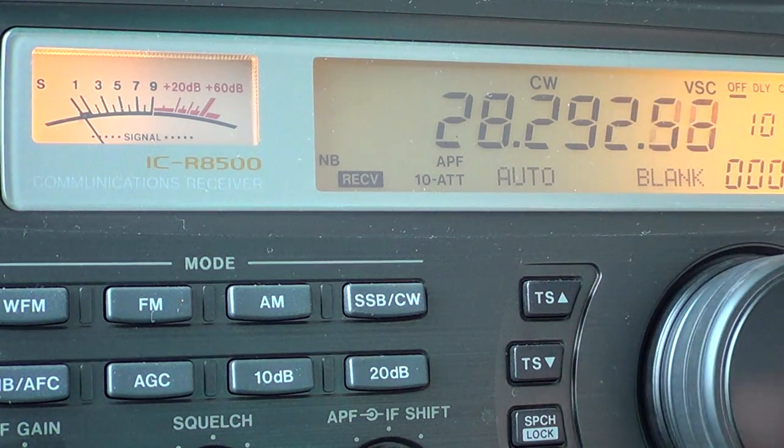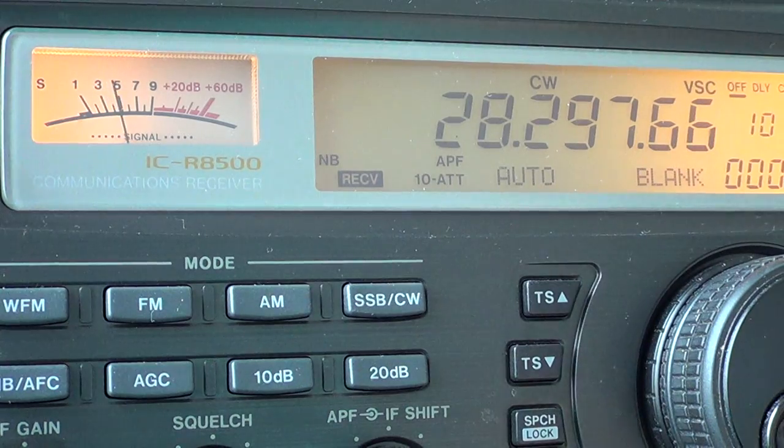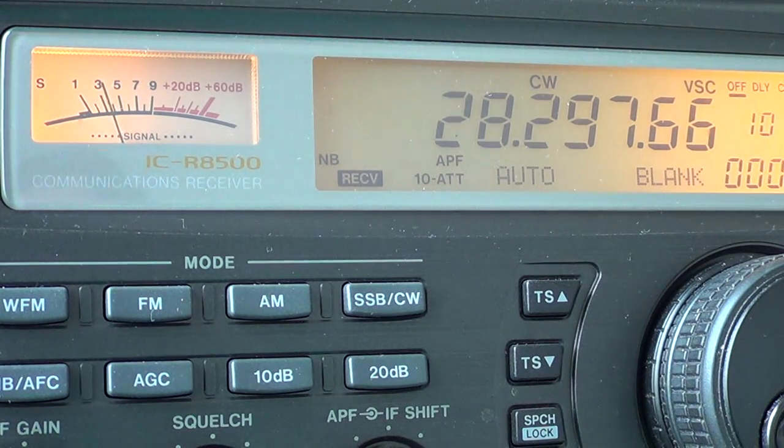And basically, for example, if the only beacons you hear are from the United States, well, you know that propagation to the United States or North America probably is open. If the only beacons you hear are European, well, propagation is open to Europe, which means that if you start tuning higher in frequency and listen to amateur radio stations in upper sideband, for example, you can expect to hear stations from these areas.